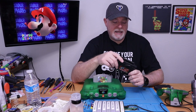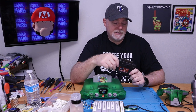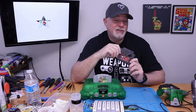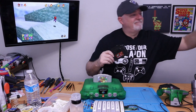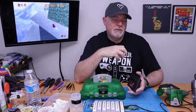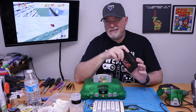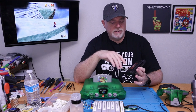The thing is, they rarely die. I get them in all the time, and the reason I'm making this video is because I happen to have two on the bench right now. I want to walk you through the ways that you can unbrick these. If you have a version 2 or higher, a device like this can just re-flash it. But below version 2, the only way to re-flash the memory chips is to literally de-solder them from the board, flash the two chips individually, and re-solder them back.